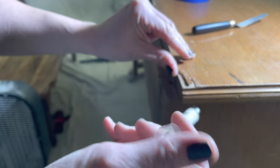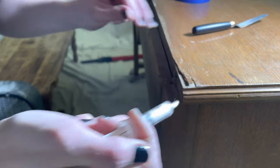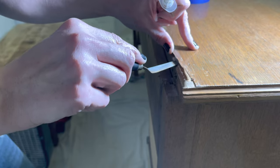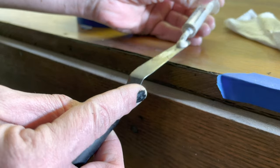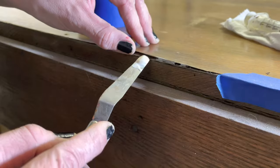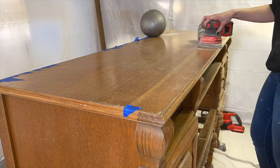Now remember, I am not a professional furniture restorer. I usually paint furniture but I've learned a couple tricks. I'm going to glue these pieces of veneer back down using a little medicine ball, a pen dropper, and a palette knife. That way I can get underneath the veneer without breaking it off and raising it even more. I'll apply a little painter's tape to hold the veneer down tight while it dries. That weighted medicine ball is holding a little bit of bubbled veneer down while it dries.